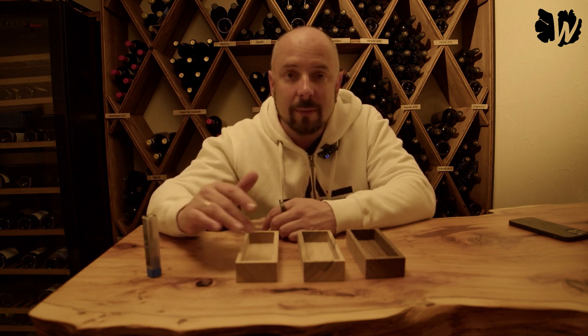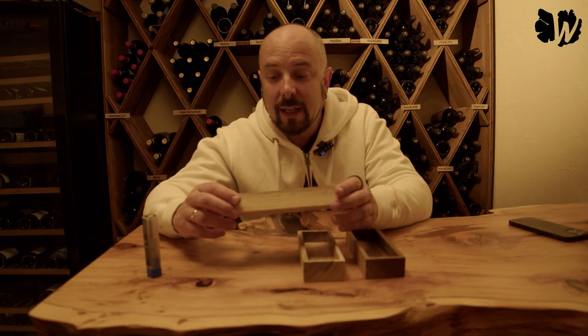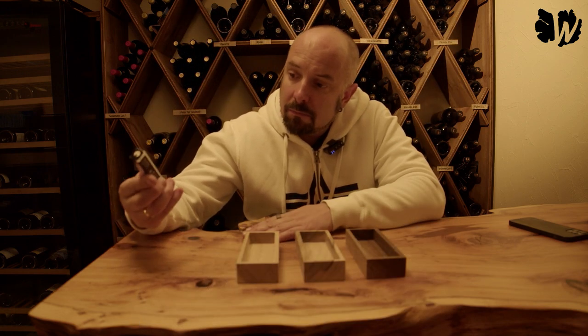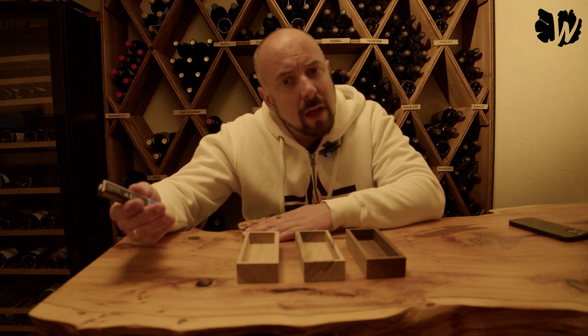It went really well. It was easy to remove all the material. I removed the pocket cut and then did an outside cut and it worked really well — it's nice looking. One of the corners has a little mark which I can't really explain why it happened, but other than that it went well. The router bit after using it looked like new — no major signs of wear. I am quite enthusiastic about how easy it was to remove 20 millimeters of material with this bit. So I continued testing.